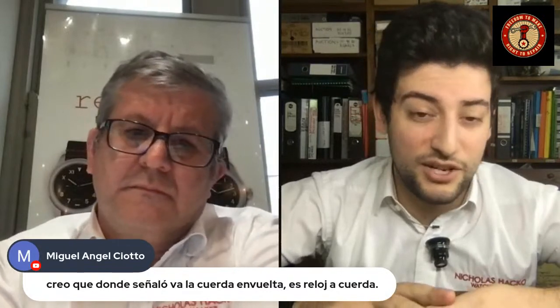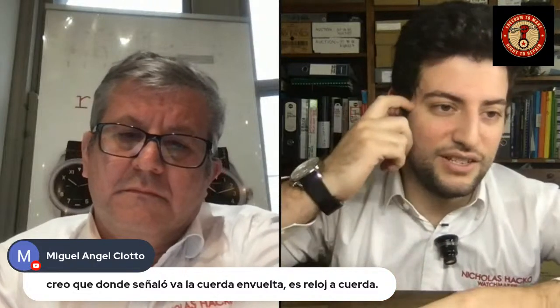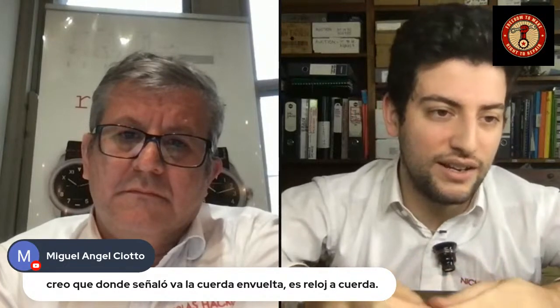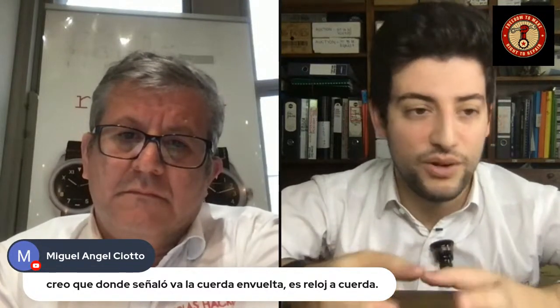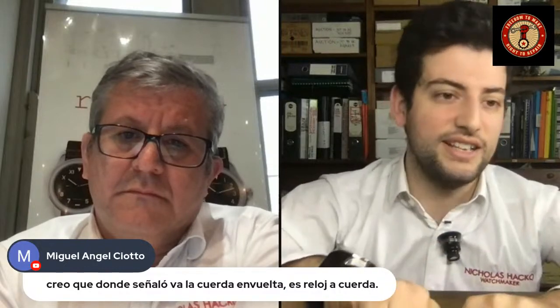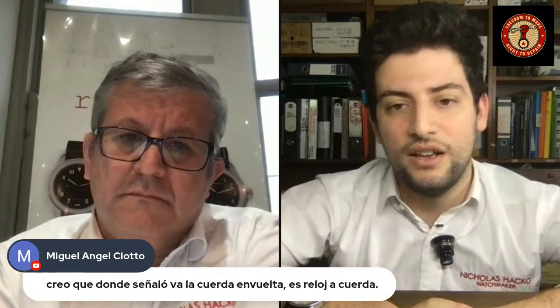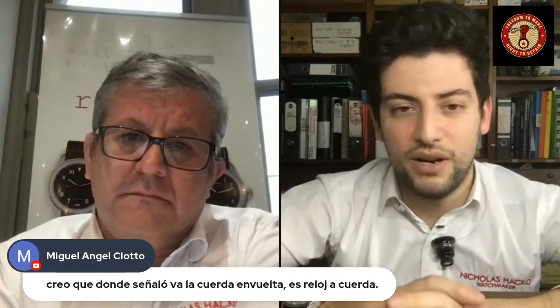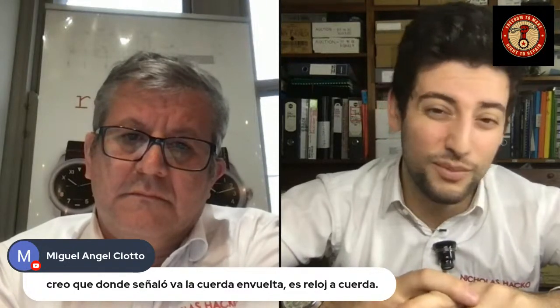And there are times where for a very specific part, especially if it's vintage, it can take months. One example I can give is we were working on a vintage Zenith, which basically had so much wear on a post that was machined into the barrel bridge that we needed to replace the barrel bridge. And this has an engraving on it, so you need to get the correct one. You need to have the correct caliber. So we were going from part supplier to part supplier, at least in Australia, for I think maybe 2 months.